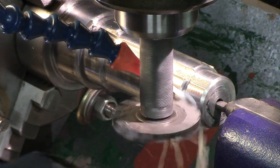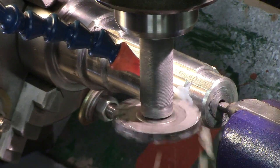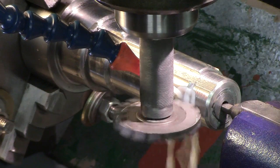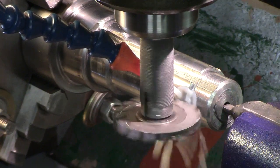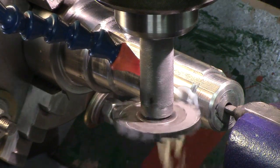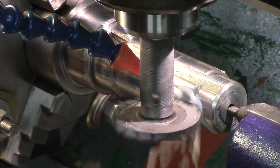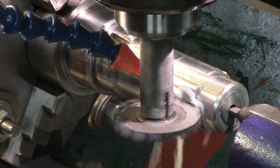You guys have noticed the mill is running a lot quieter. I was able to find out that in the head - I hadn't really had a chance to go through and clean and inspect in there - I got up in there with an air hose and blew out a bunch of garbage. There was a little piece of a broken belt underneath the front and back gear section that helps you switch between front and back gear. It was really, really dry up there. Plus I found a bearing retainer on the very top that sets the preload on all the bearings - I got about a quarter turn out of it to tighten it up, so that really tightened everything up.